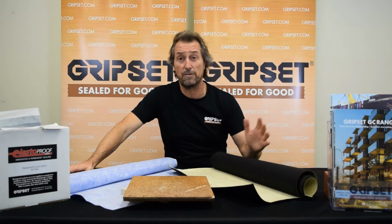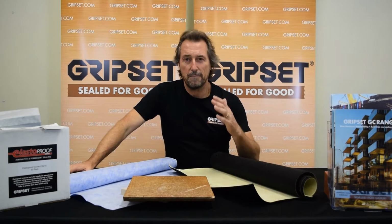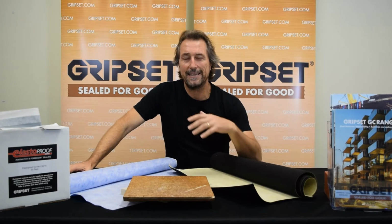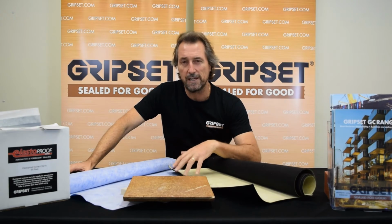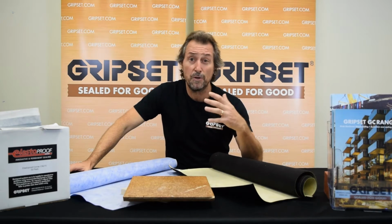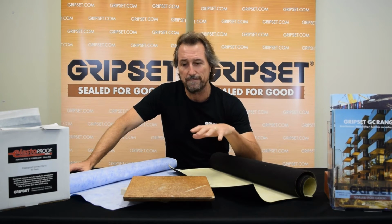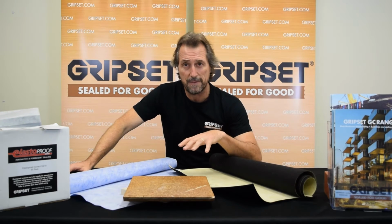So firstly, let's look at internal wet areas. Most builders these days will use an inert material. Inert meaning that it doesn't react to thermal temperatures, like cement sheeting, compressed fibre sheeting, or things that we see now like Skyon, Hebel. There's a number of other substrates out there that are of a synthetic base, or your old form concrete that is used for wet area flooring. It's more stable, and even though it still has to be waterproof, it's not as volatile to temperatures.